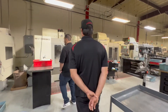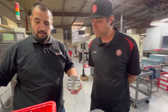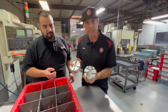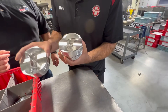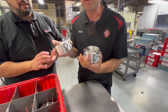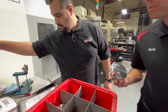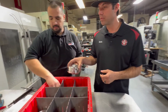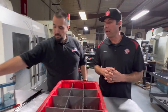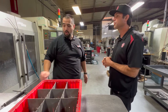This machine here does our under crown. That's what the piston would normally look like at the bottom — this one has an under crown on it. You can see the difference: this is how it starts off life, and then this is the under crown milling. All the extra features cut away are to make it as light as possible. This piston weighs 519 grams, this one's at 538 grams — so by milling the under crown, you gain 20 grams right there, and it's still not complete, it'll still drop more.